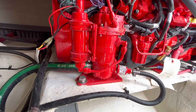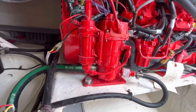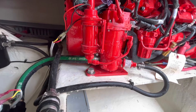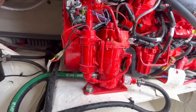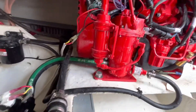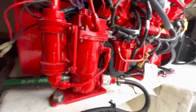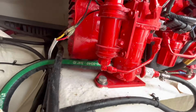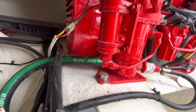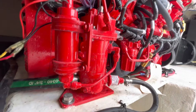What if you're running at cruise and you can't hear the generator shut off? You don't know if it's shut off when you're running. So that's just not good advice. They should have installed this. If they're going to run a high-speed pickup for a generator in a boat that runs this fast, you have to have something that shuts the water flow off from the through-hole to that piece of equipment. If I took that raw water hose from the strainer off that engine and got up to 32 to 35 miles an hour on plane, it'd fill up a five gallon bucket. That's trying to force into your engine and it's going to introduce that water into your cylinders. That's why they tell you to shut the seacock off.